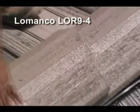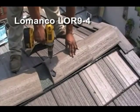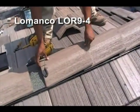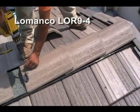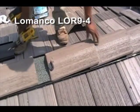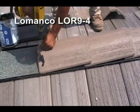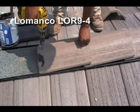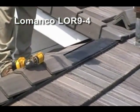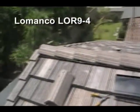Next one goes on. See, it grabs onto the ridge board. Next one above it. The 4 to 5 inch screws work perfectly, and they grip down to the ridge board, which is set down about 4 inches. This is the complete ridge,